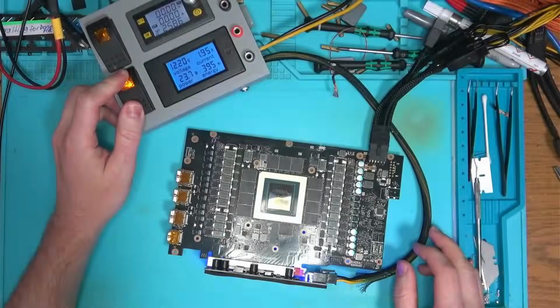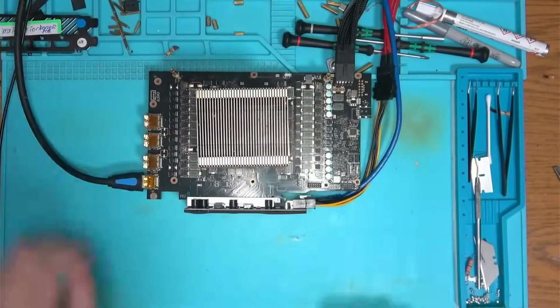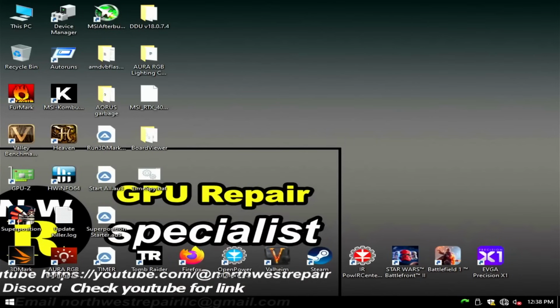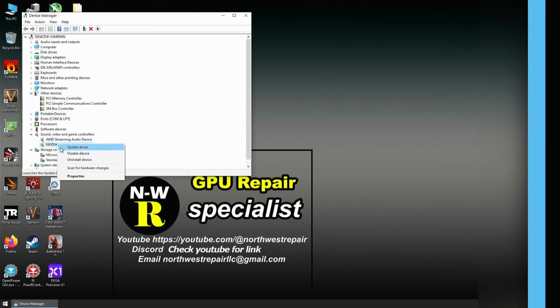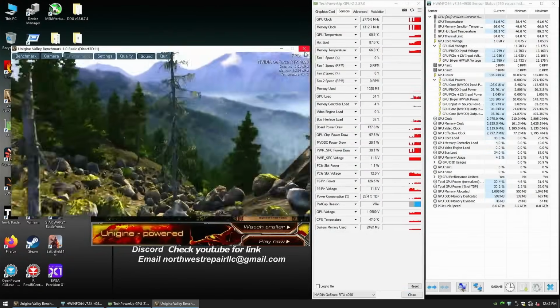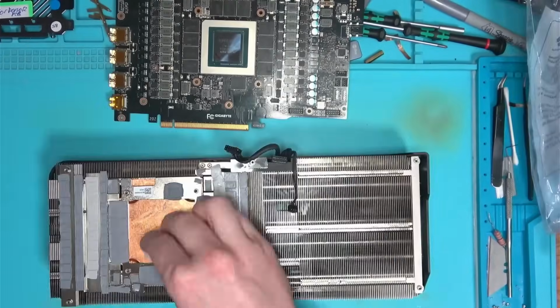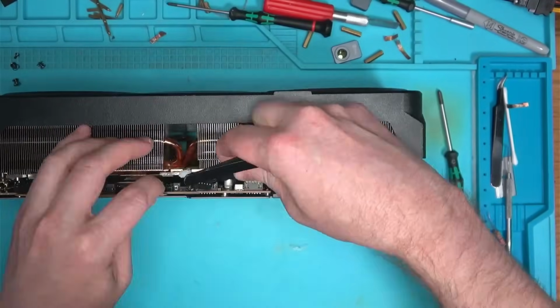Looks quiet to me. So I booted up and it posted. But as soon as I tried to run the Valley, I got a black screen. Next boot, I disabled the NVIDIA drivers and now the Valley works. This does happen from time to time because a lot of graphics cards get inserted without removing the drivers first.